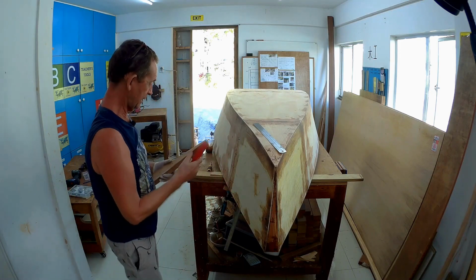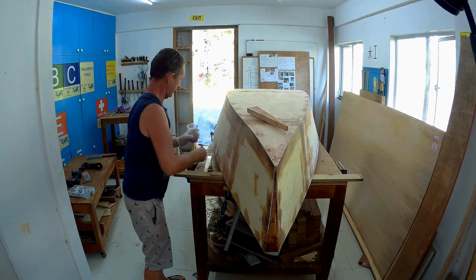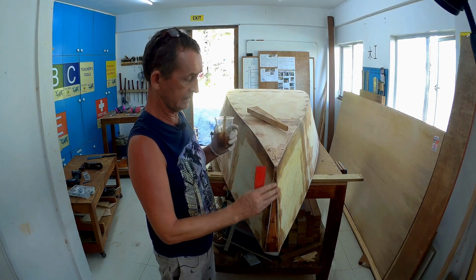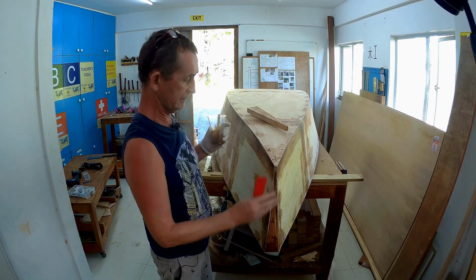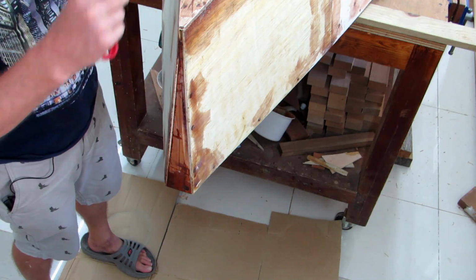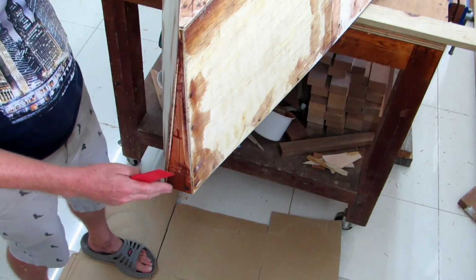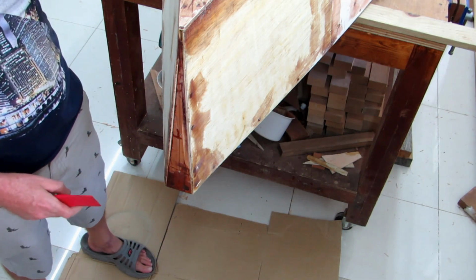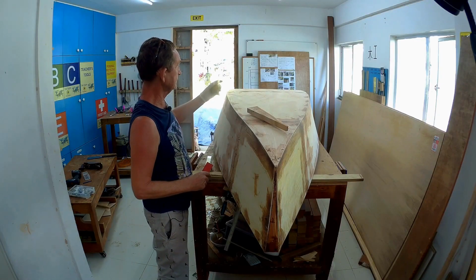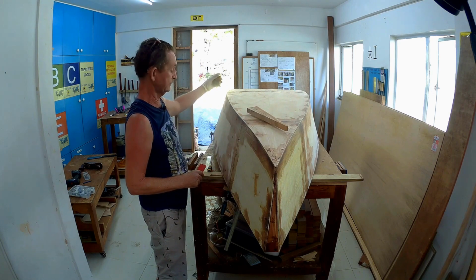So I made up my epoxy, and I put filler in the epoxy, of course, because it's thick. And we're just going to put it on then, and we're going to leave it. And then tomorrow, before we do the glassing, we will plane this all up, and we will taper it the best way we can, and make it look nice going through the water. And then we're ready for glassing. So I want this on beforehand. The skeg at the back, no, we put that on after the glass. That's what it says, and the same with the 2 strips.